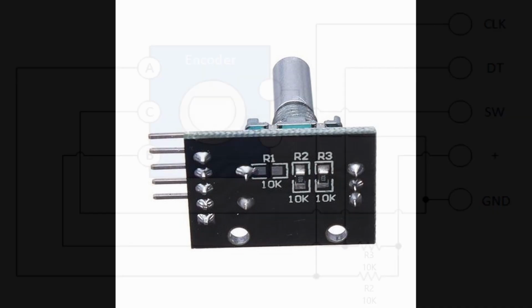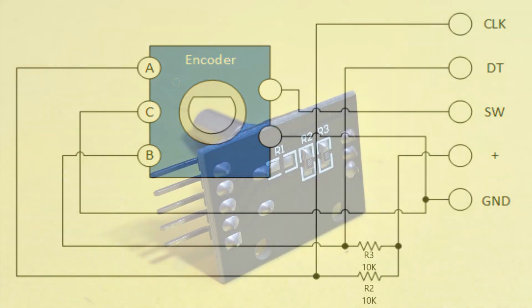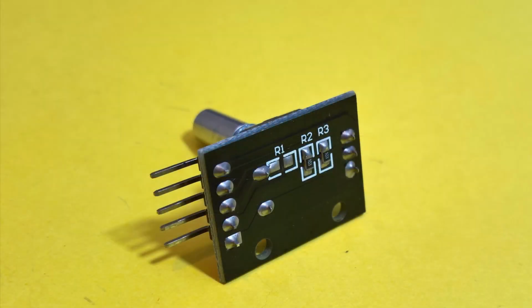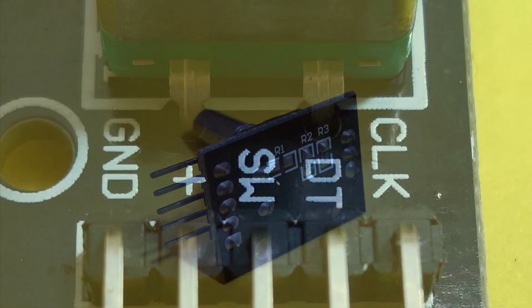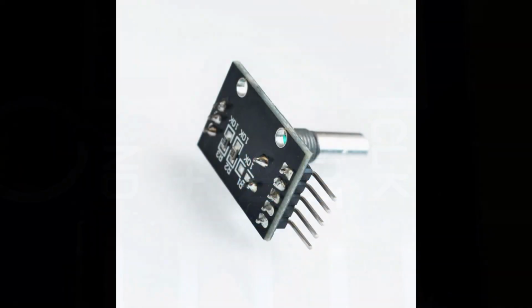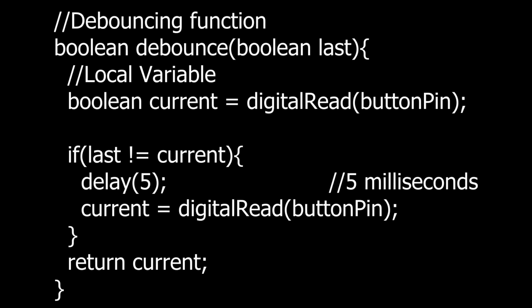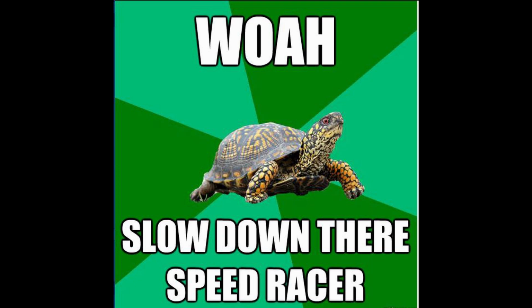The truth is that the switching action happens so quickly that a fast detection routine is needed to accurately capture all the states from pins A and B. And yes, I had to learn this the hard way. At first, there was a lot of switch bouncing that caused problems. I tried just debouncing each pin with software, like the one we created in the digital inputs lesson number 5. But the delay caused inconsistent results and incorrect rotational movement. Well, that's because the software is just too slow, and the delay just compounded the problem.